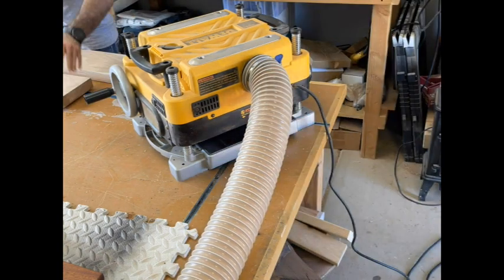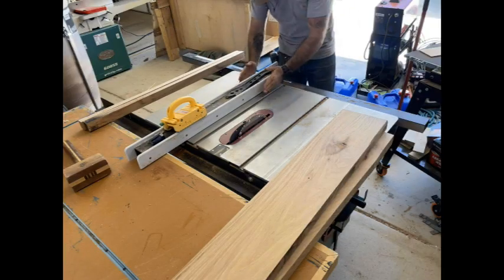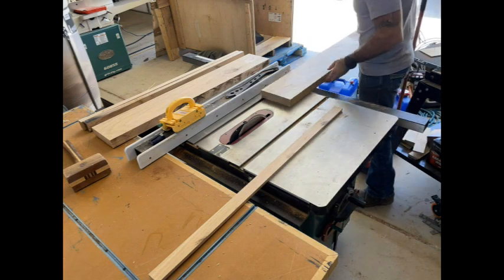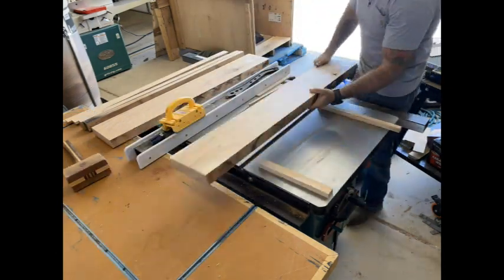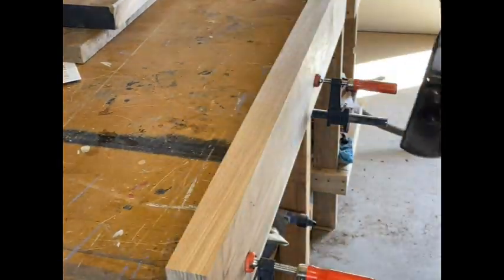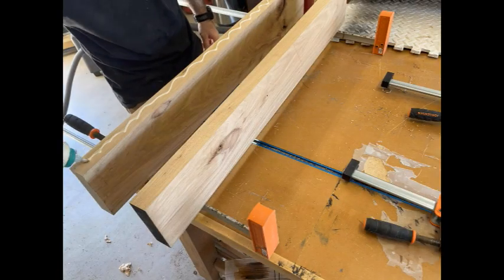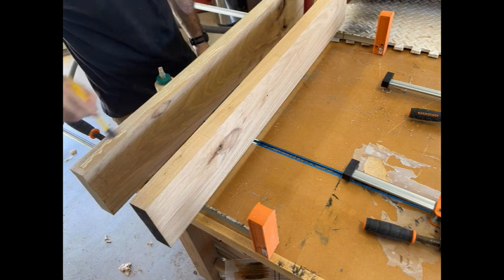After I face joint and edge joint the hickory, I'm bringing it over to the planer. Then you see me trim up this hickory to a little over 6 inches of board. I didn't want this thing to be super wide — I think the final length was somewhere around 12 inches or 12 and a quarter. I cleaned it up with the old number 7 here to give me a nice clean and almost invisible glue up. Or at least that was the goal — whether I got it or not, we'll see if anybody notices. I thought it came out pretty good.